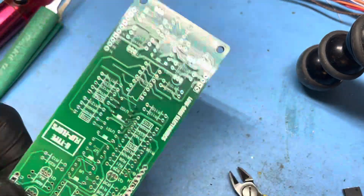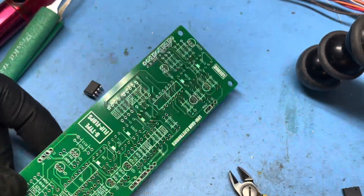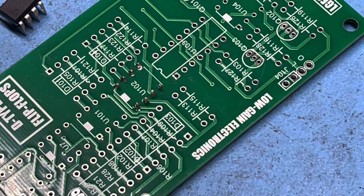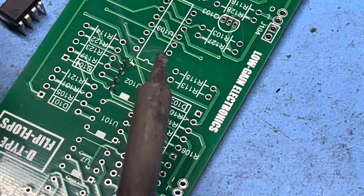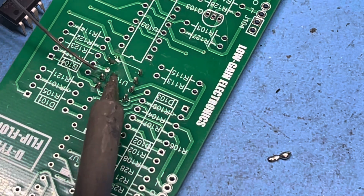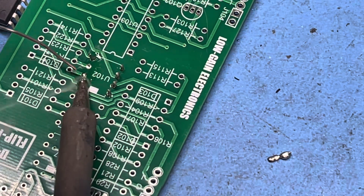You're left with just the pins sitting in the board. What I'm going to do is apply a little bit of solder to each pin, because adding a little bit of solder is kind of like lubricating the joint — makes things flow. You might find that the pins actually just pop out when you're trying to add more solder, which is okay.